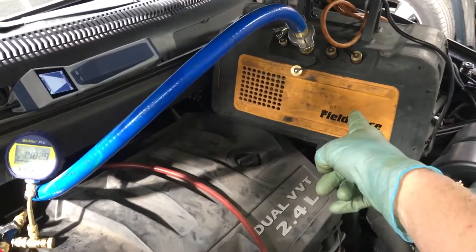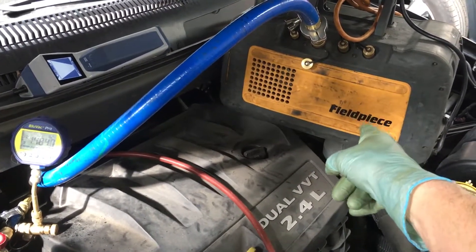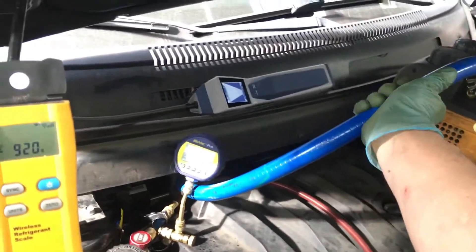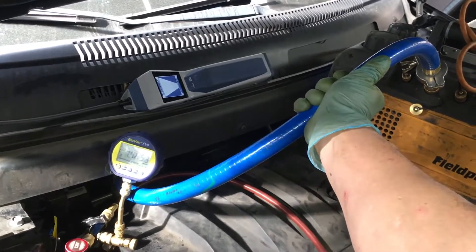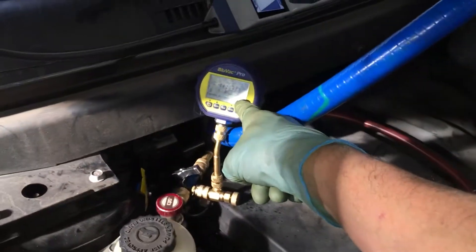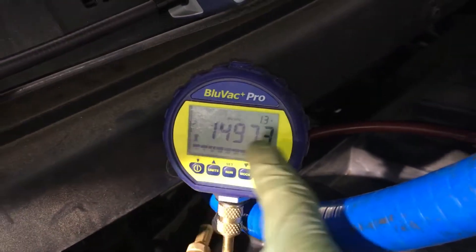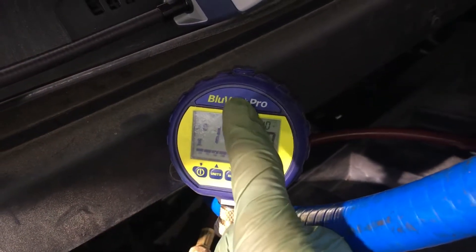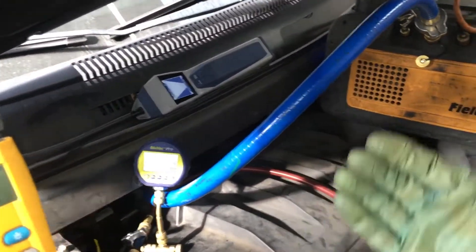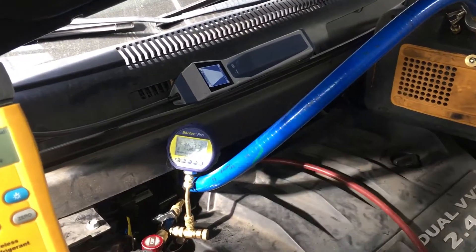Here's a quick recap for those who are first watching this channel and just stumbled upon it: 8 CFM vacuum pump from Field Piece, silicone deep vacuum hose at three-quarter inch, shut-off T, shut-off T, and a micron gauge — Blue Vac Plus Pro. When you look up this part, make sure you get the Plus Pro. This is the one you can tie into software on a computer, laptop, or PDA, and you can actually data log and record your pull-down vacuum.